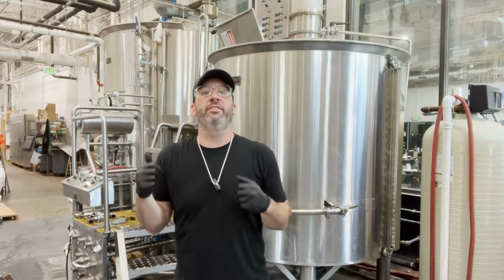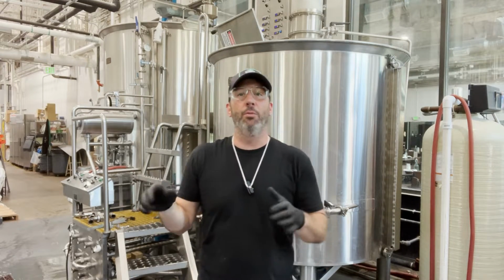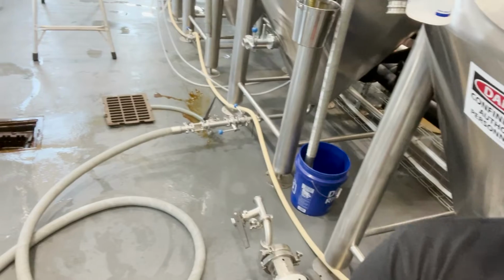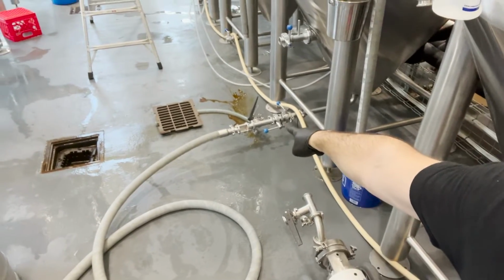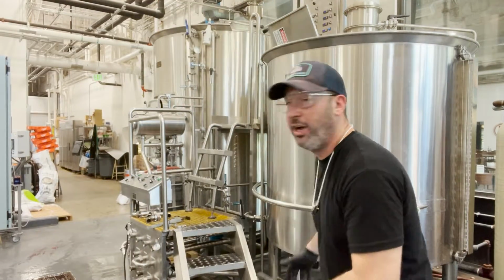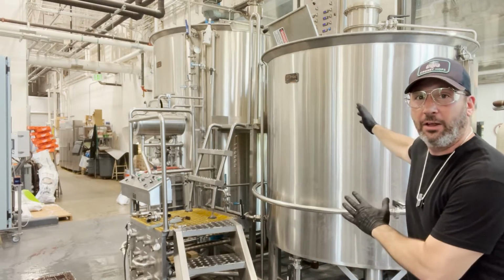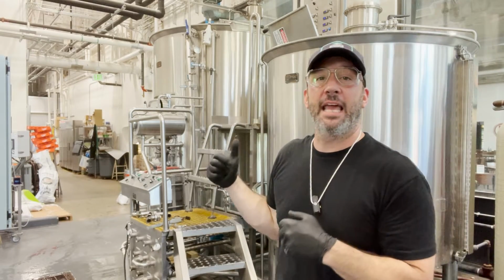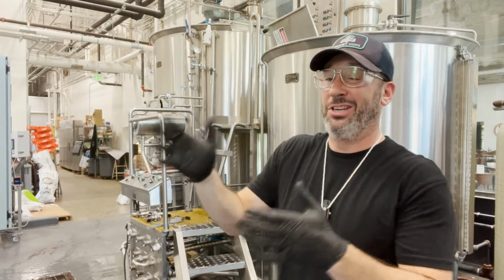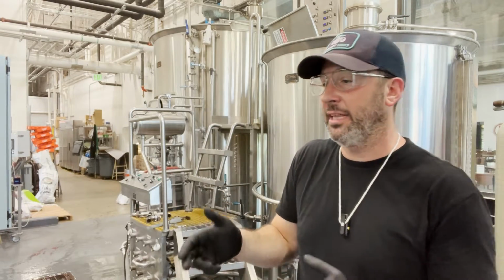But we just finished brewing right now, and where we're at, we have a line going to the fermenter right here that we were just filling. And so that's our runoff line that's coming off of our heat exchanger, and that is attached to the heat exchanger, which is linked up to our kettle. We have a little bit of wort left in the kettle and tube that we weren't able to move through cleanly, that we don't want to be pushing through our heat exchanger, everything like that.